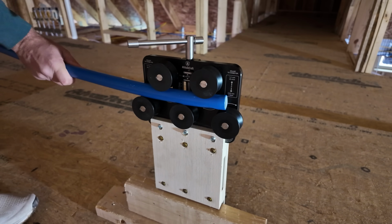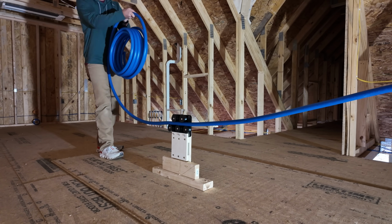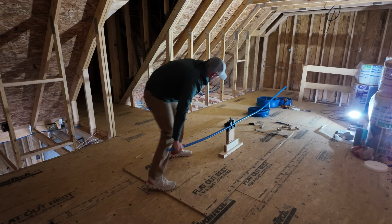This definitely took some getting used to, since this tubing seems to have a lot of elastic memory and wants to return to the curved shape that it started in. I found a combination of hand straightening as much as I could, cutting to the length that I needed, and then running it through the rollers actually worked best.